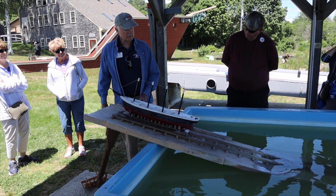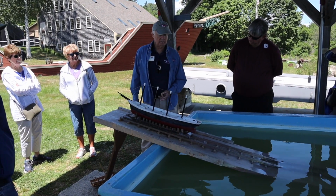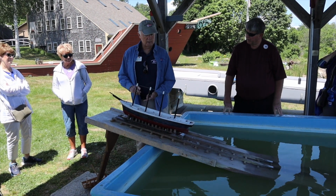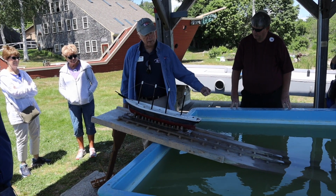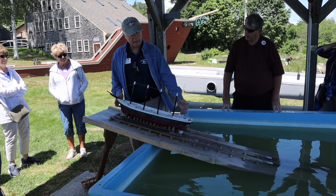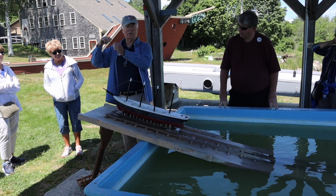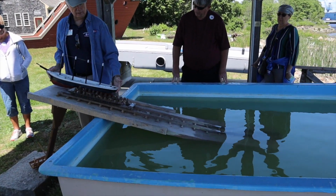So now they muster another small detail of men, and this is like 3 guys. And these guys have axes, mauls, and splitting wedges, steel wedges. They send them in under the stern of the vessel, and these guys start knocking out the keel blocks, splitting them. Now remember, the keel blocks are 5 feet off ground, so they're swinging overhead like this. They're under the stern of the vessel.